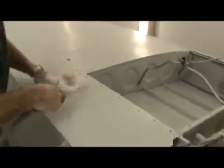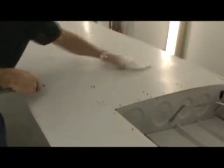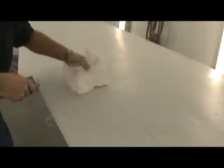We wet the spray room floor down, rolled the wing in, and we're doing the final blowing and wiping off prior to mixing the paint. We used a new terry towel. Before we mix our two-part poly, we always want to check the spray gun first — sometimes you'll mix the paint and find a spray gun issue, and with a paint that has a pot life, that's not very good.